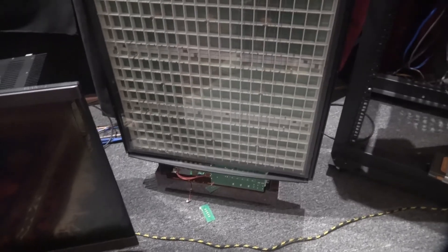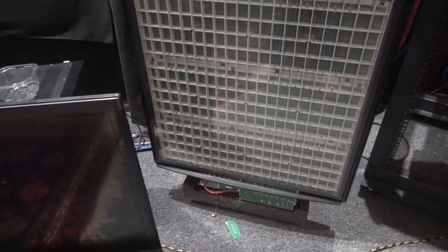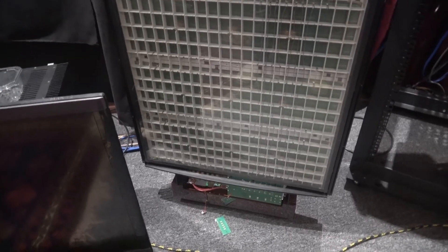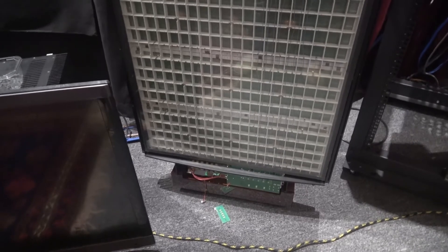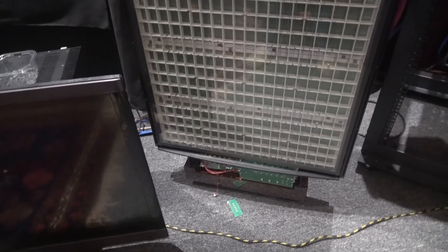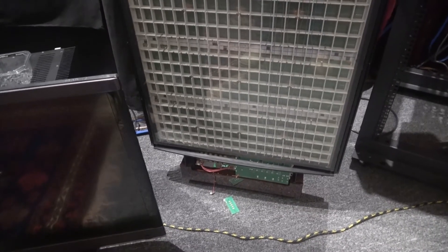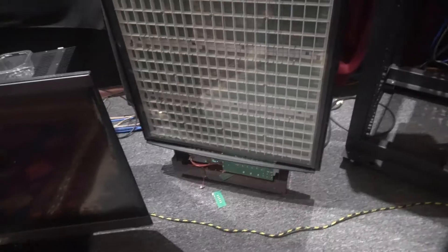On the 63's there's no light, of course — there's a little red LED on the rear of the speaker, that's all. In this model, the on-light is actually the Quad symbol at the front, but it's also connected to the protection circuitry. So it doubles up as an on-light as well as an indication that the protection circuitry has acted.